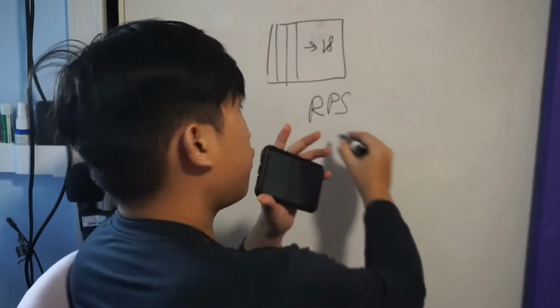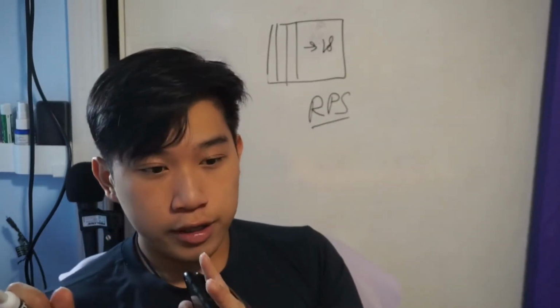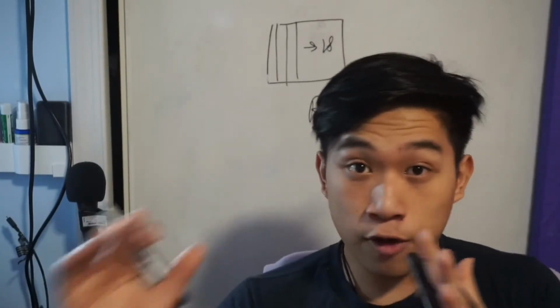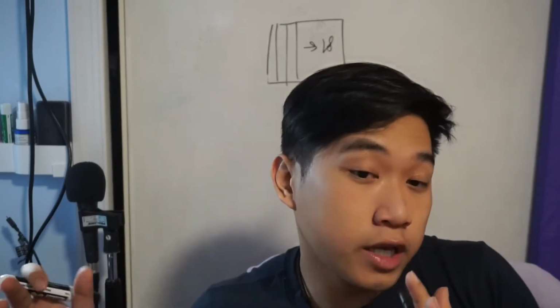I have to figure out the revolutions per second for the motor. The reason why that's important is because then I know its maximum rotational speed to then calculate how many gear rotations and gear reductions I have to make in order to get about 30 seconds of playtime. Then from there, I could design how big the cylinder has to be, print everything out, put it all together, and hopefully it will work out.